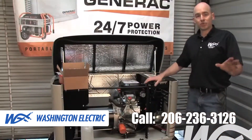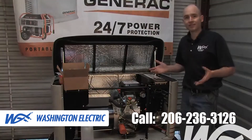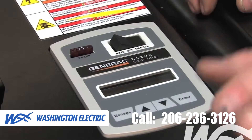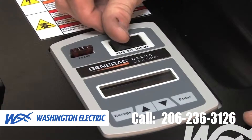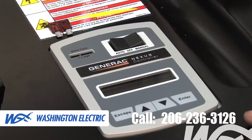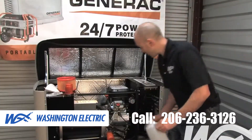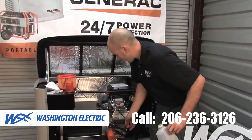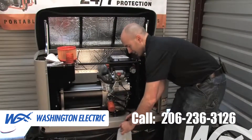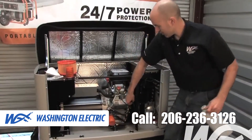Let's briefly look at how we would go about installing this maintenance kit. The first thing you want to do is turn the generator on and let it run for five minutes so the oil can warm up and drain out more easily. Then turn the generator to the off position and pull the fuse so the generator cannot turn on while you're servicing it. Take any suitable container — there's a drain hose located right here. Twist off the cap and drain the oil. Once done, replace the cap and reinsert the drain hose into the clip.